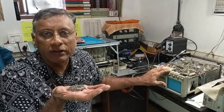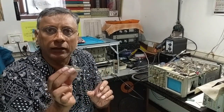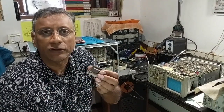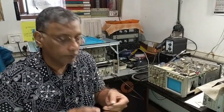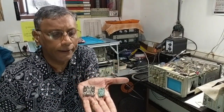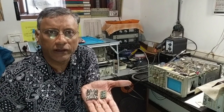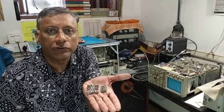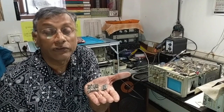The U400 is actually a channel switch — a hybrid IC with a metal casing and a heat sink inside which the chip is sealed, as you can see. The replacement that I built looks a bit like this, and for comparison I put both of them on the palm of my hand. You can see it is a fairly small PCB with components on both sides, uses a couple of high-speed op-amps, and this will just drop into the slot originally occupied by the U400.